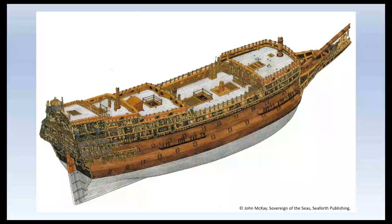When the final specification and model were presented to the King, he made numerous changes to the aesthetic appearance of the ship, including adding a massive number of decorations, all of which were to be gilded. He also insisted on increasing the armament to 102 cannon. This gave the shipwrights a problem: as a 90-gun ship, the length of the lower gun deck as designed and approved would not accommodate any more cannon. The answer was to increase the breadth to 46 foot 6 inches and have a further deck to make three gun decks. This increased the draft of the ship to 22 feet 6 inches due to the increased weight. A further complication was that the lower gun port sills were now only 3 feet 6 inches above the load waterline, which would later prove to be a significant problem when fighting the ship in any sort of inclement weather.